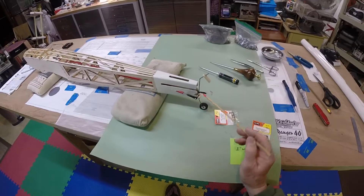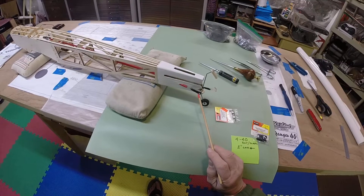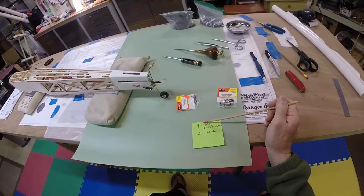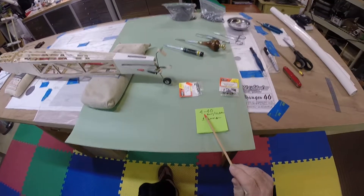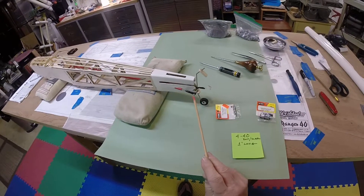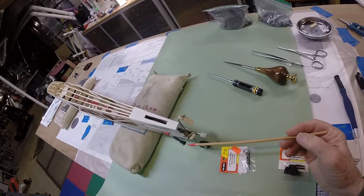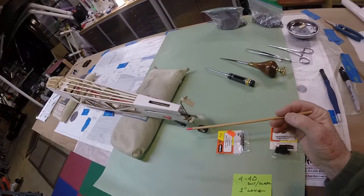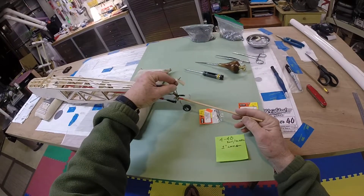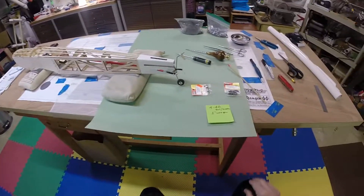This arm is the key part. You need to cut it off and shorten it so that it will fit in here, and this threads in here. You also need a bolt — a number 4-40 bolt, cap screw, whatever you want to call it. It threads through this arm right here, threads through here, and goes into this collar that you put on the axle.